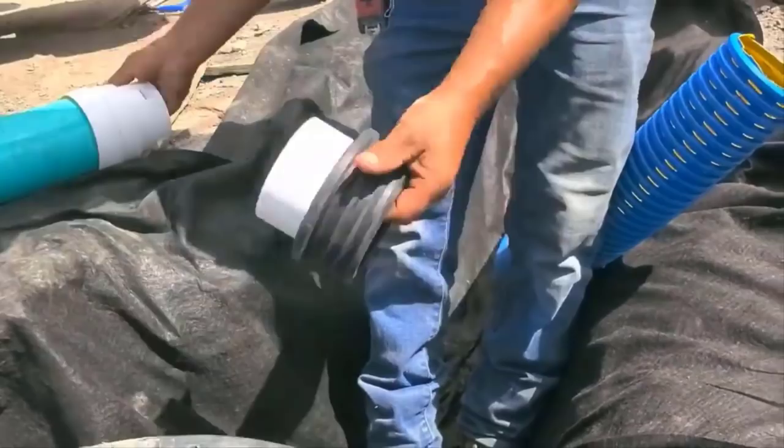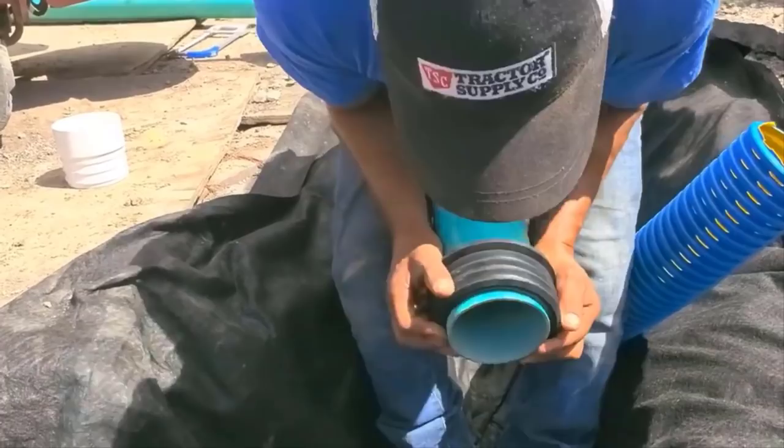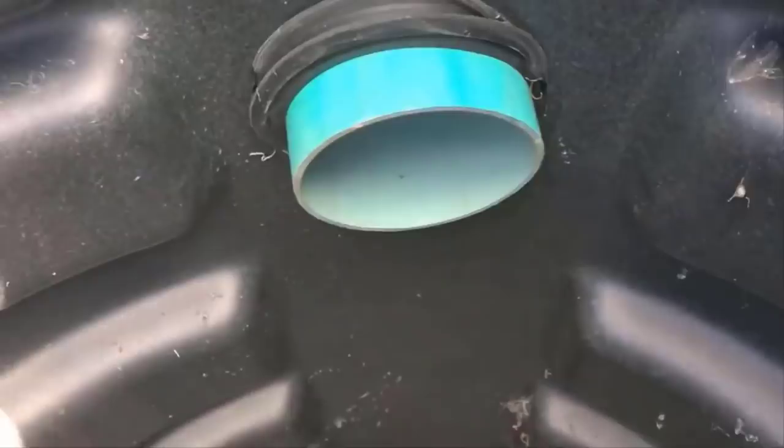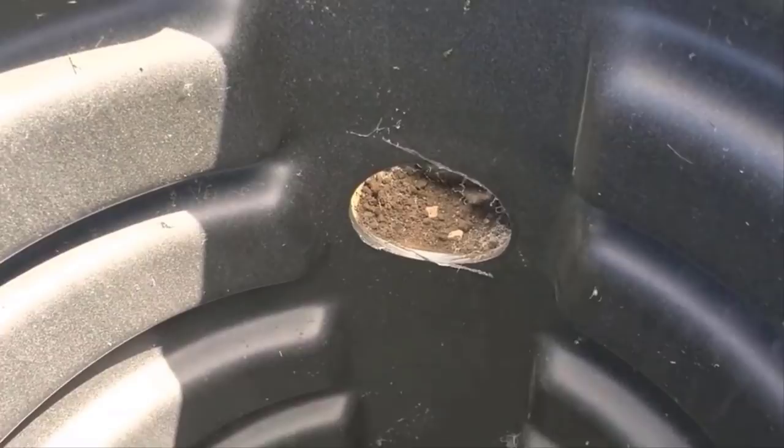All right, we've been using this rubber gasket, and I want to show you guys what we do so that you're not losing your stone into your crocks or your sump pump discharge, your lift stations, whatever you got going on. It's a 4-inch by 4-inch rubber gasket. You drill with a hole saw that is 5 inches, and these seal up so nice, and it's such a great fit. And that way you're not losing dirt and stone.